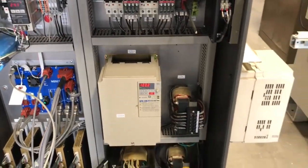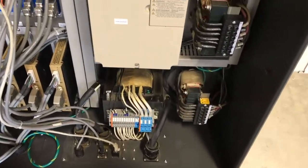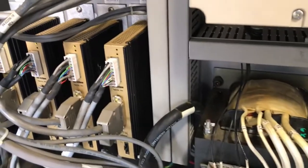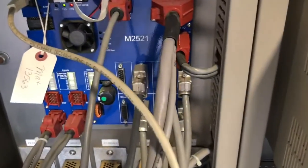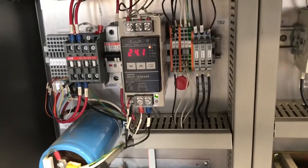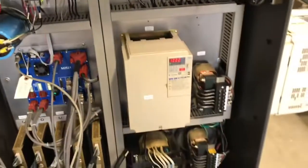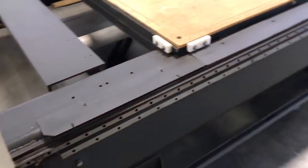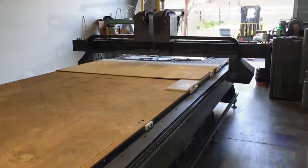We're going to take a quick look inside this cabinet. You can see the two VFDs for the spindle — one on the outside, one on the inside of the cabinet. Down here we have five servo drives; those are the SST Eclipse Technic models — very high-end, very good. The motherboard is the M2521, which is a newer generation. Up here we've got the more modern 24-volt power supply, a lot more reliable than the older style, and a tap transformer down below to really dial that in. This is a quick look at our Multicam 80 inch by 193 inch table.